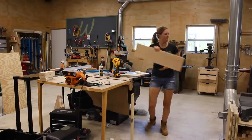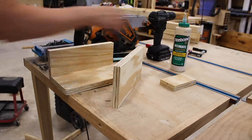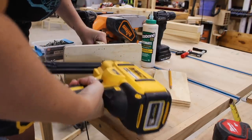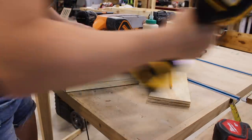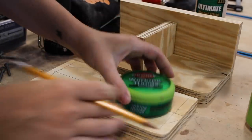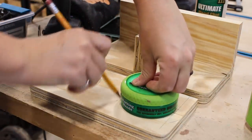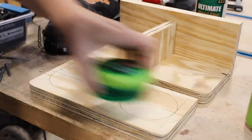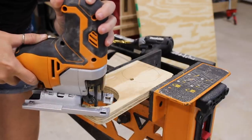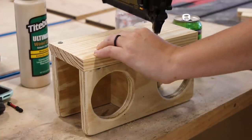Now let's make something to hold drinks. I cut a few pieces to make up an L-shape — the bottom and the back of the holder. I pre-drilled and then used a few screws to attach them together, then cut a small piece to act as a divider so the stand will actually hold two drinks. I grabbed a round thing in my shop a little bigger than a can and traced two circles onto another board, then used a jigsaw to cut them both out. I used wood glue and brad nails to hold it in place while it dried.